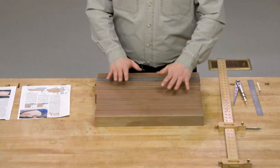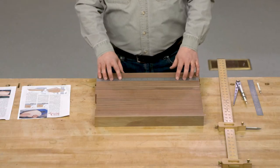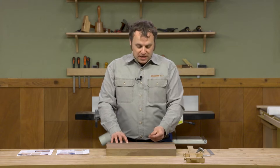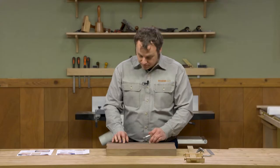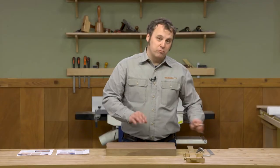The seat for this first stool starts as a large glued up blank. We're using walnut here and it's going to look really cool. The first things you need to do is take care of a little layout and it involves some pretty fun geometry. The first step is to establish a baseline for creating that overall rounded triangle shape. I'm going to use a large ruler and, because I'm working with walnut, a white colored pencil - it's a lot easier to see those lines. I'll create a baseline that's 10 and a half inches long and mark the end points, forming two points of our triangle.